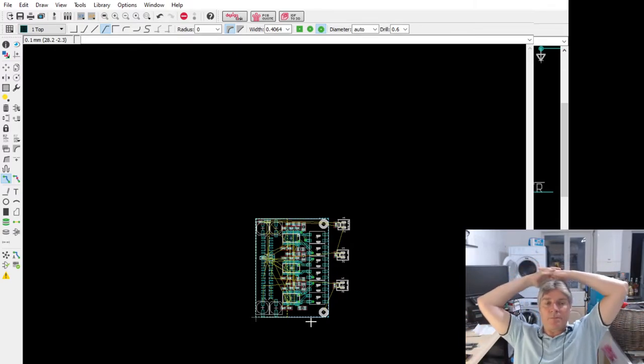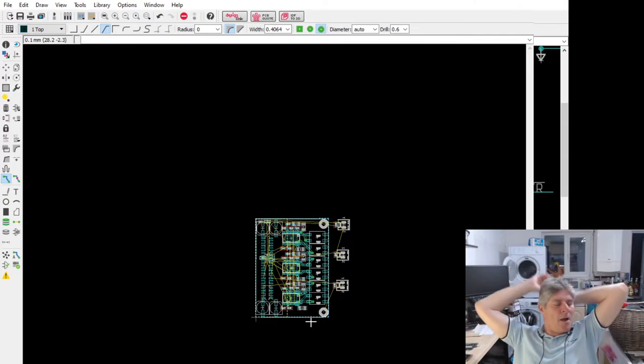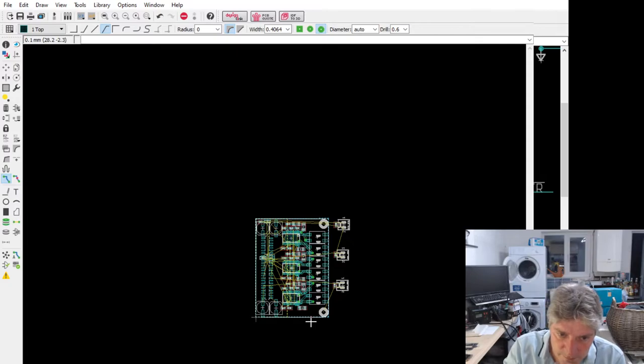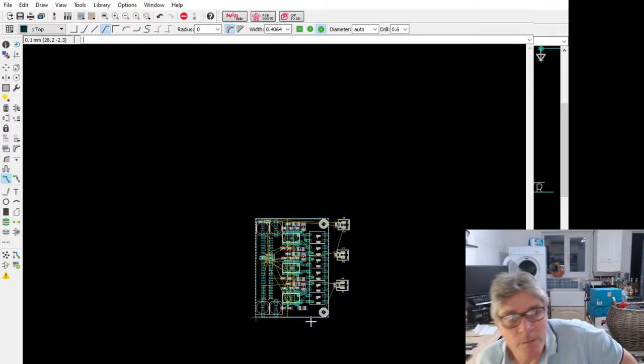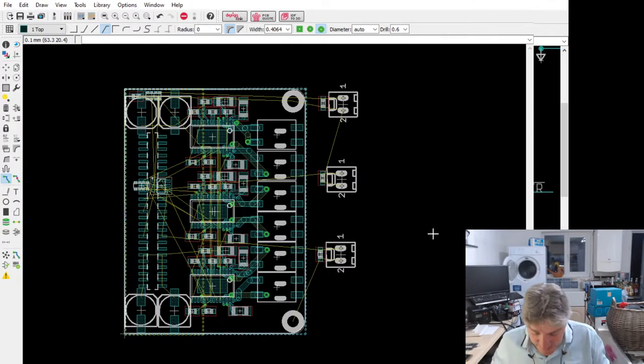On the mixed signals. Those could be used for homing, among other things. For end stops. You need those for the open loop motor controls. I do already have a header for the mixed signal parts. That's unused. I could repeat that.